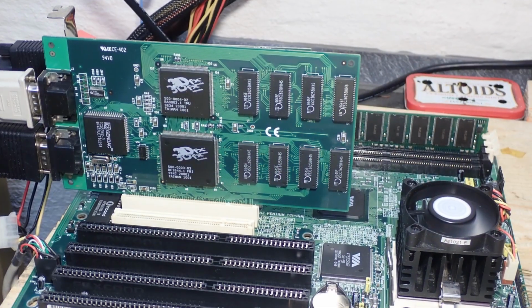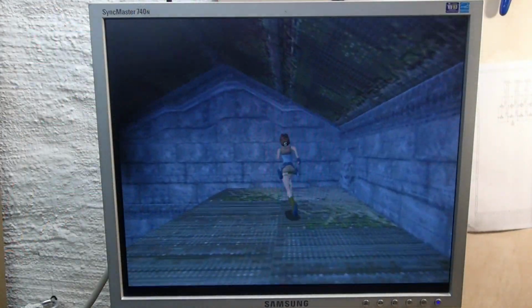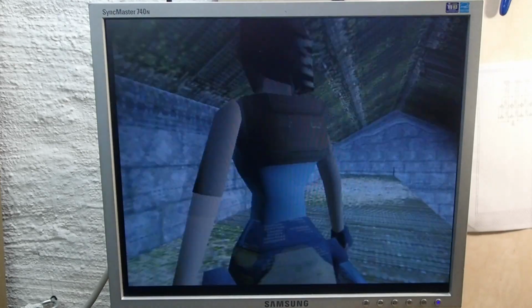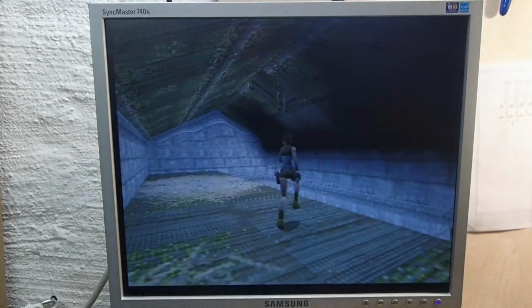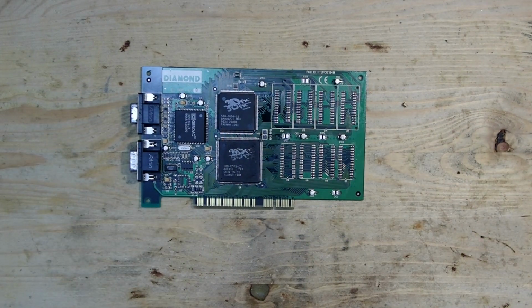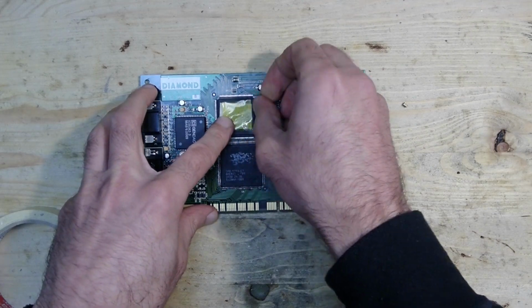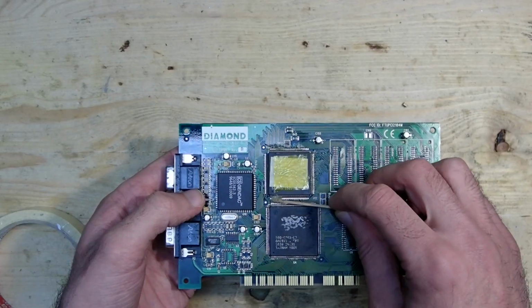Well, just in case, off camera, I replaced the other 4 memory modules, which belong to the frame buffer, but just as expected, it didn't bring any improvement. Well, maybe the memory from the donor board was defective as well. Unfortunately, I can't validate it now. However, I'm still quite sure that the issue is related to the texture unit, and I guess we can go another step forward and try to transplant the TMU IC from our donor card. It could be broken as well, so it is kind of flying blind, but what do we lose again, yeah?